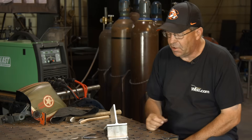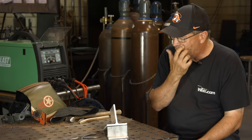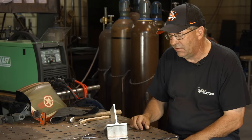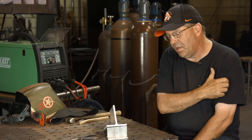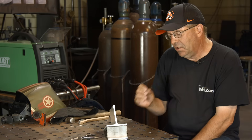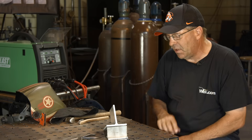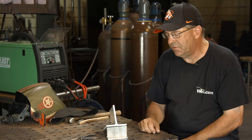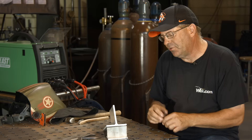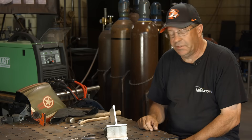Thinner aluminums, you could go lighter amperage and move up faster. This whole thing goes pretty quick — you've got to have a pretty fast hand and dab it in there. One thing I haven't done with this is lay wire and wash over it — I don't think it would go very well. I have a hard enough time seeing the pool because of the black soot around it. If you've not done it before, sit down on some material and just run some beads. As the material heats up, which is going to be really quick, you can back off the amperage to maintain the same size weld. I did this last spring with my students and a couple of them, since they could not see the pool, melted right through a piece of quarter-inch aluminum — just blasted right through it.